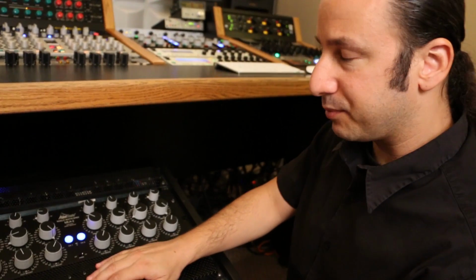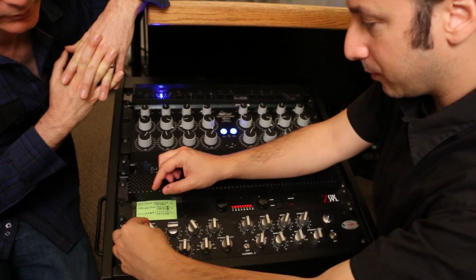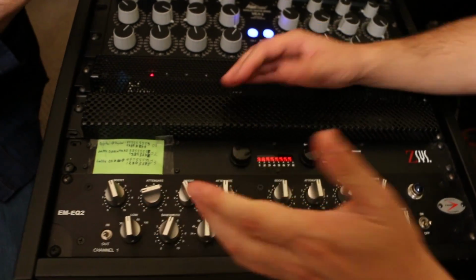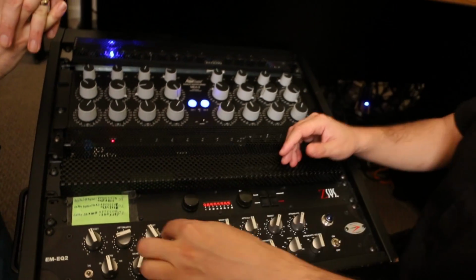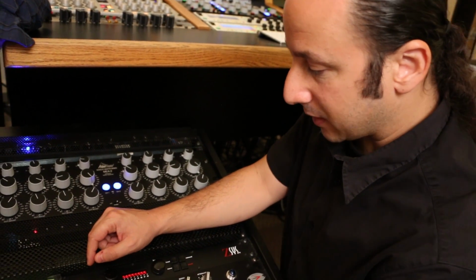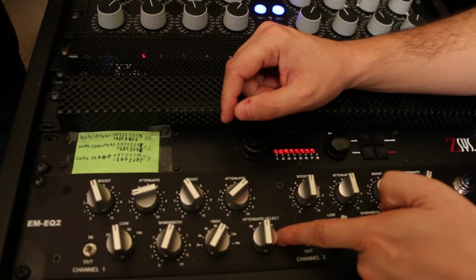And it's a passive EQ. It's more of an older design. So when you do low, boost, and attenuate, those three are working together. And then you have the bandwidth, and that's how much the upper section would work, if you have a low Q or a high Q, broad stroke. And then you choose here the frequency and you boost. Now, this would work with this, and then this attenuation works with this one.